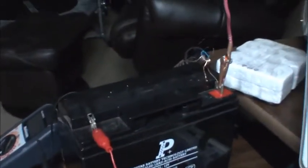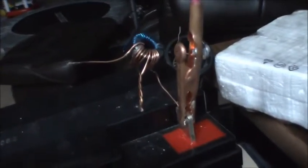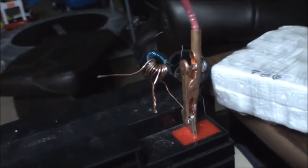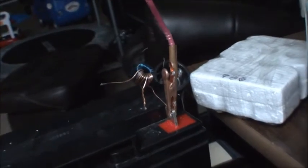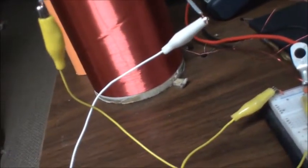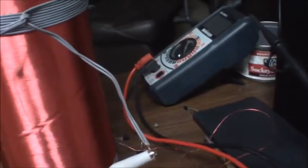And the other thing that I noticed is that if you want to control the input, you can choke the input slightly. Now in that situation you can see the primary on that little choke, and I'm going to use the center tap because I don't want the whole thing, which would be basically reducing it down to 4 turns around that toroid. So anyway, if I plug it in straight up, so I'll go straight to the, see, I'm not using the input choke. Then, she didn't fire, so.